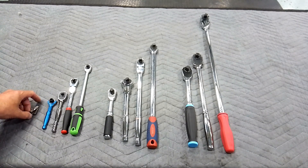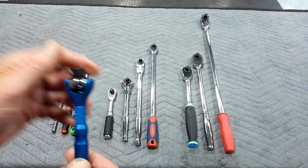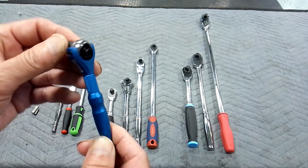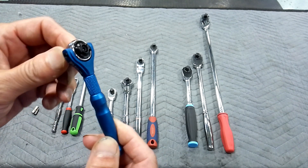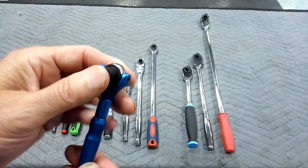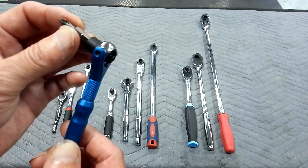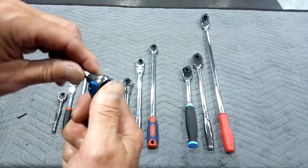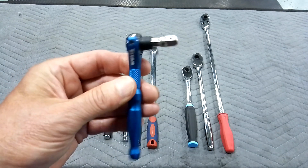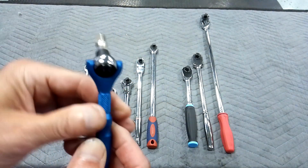Starting on the left here. Strictly my opinion, guys — I believe you need a roto head. This is a quarter-inch drive. I think there are 11 ratchets here; this is the bare minimum I think you need to get started. If you haven't got one of these little Titans — the little roto heads, 90-tooth — these are sweet. Use it as a spinner when you want to start spinning one in. What's good about this is it's actually a hex driver, but it can do double duty: you can put hex bits in it or make it a quarter-inch drive with an adapter. That's why I picked this one — that's a sweet little ratchet.